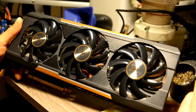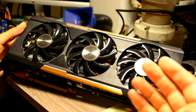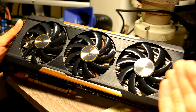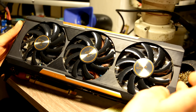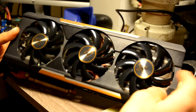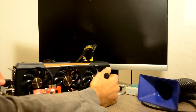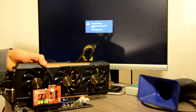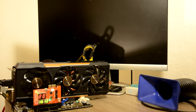I stopped on this graphic card because — just check it out — it's actually a very beast card. Talking about the cooling system, we'll open it up and have a look, but I love that it has 3 fans. Talking about memory, it's 8GB with a 512-bit bus. The core clock is 1055 MHz, and basically we can overclock it to around 1100s. This card was sold as not wanting to do anything. Let's confirm it — the post code started running and it doesn't bypass our BIOS post code. The chip is not getting hot and the fan is not spinning. There is no detection at all.